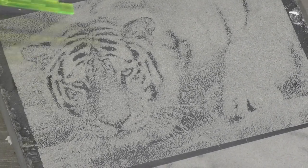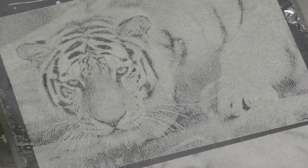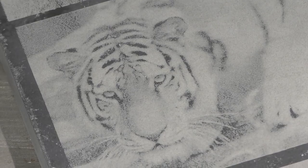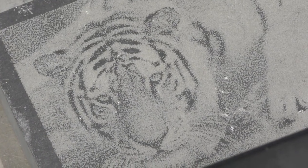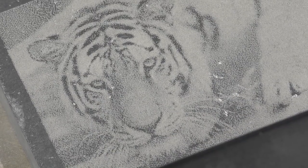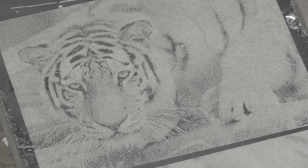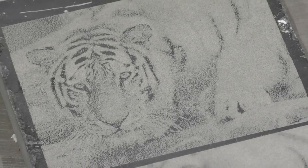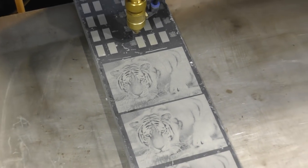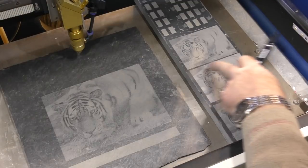Looking carefully, this is the slow speed one at 150mm/s. There's a pattern on the top of the nose that has now revealed itself - some detail that wasn't there on the previous one. At twice the resolution it's much vaguer; the pattern is there but not very distinct. The original 200 dots per inch version shows the pattern, but still not as distinct as on the slow speed version done at 150mm/s versus 300mm/s. The problem is this picture is only about 100 by 75 millimetres - not very big. There's an interesting phenomenon where if we keep the resolution exactly the same but get a picture that's twice as large, we should get a better-looking result.